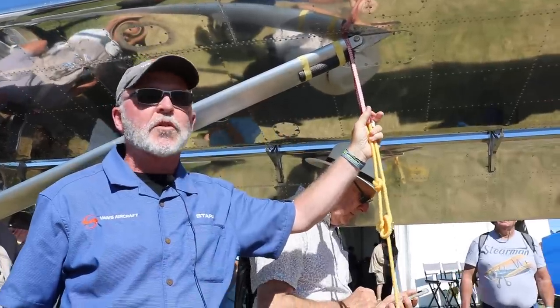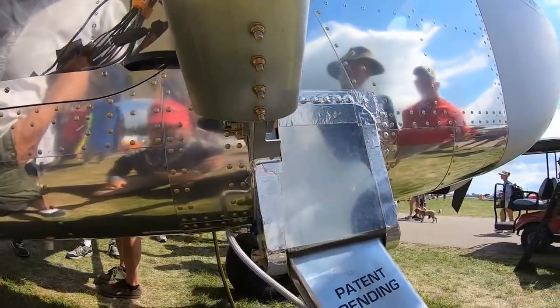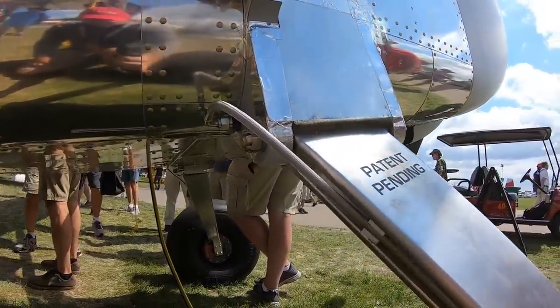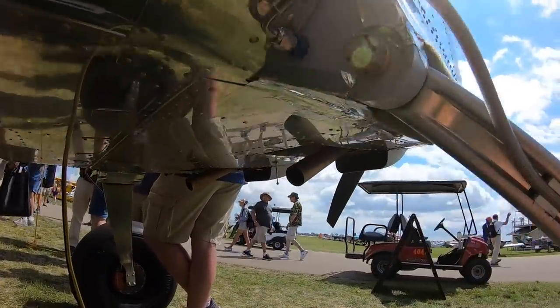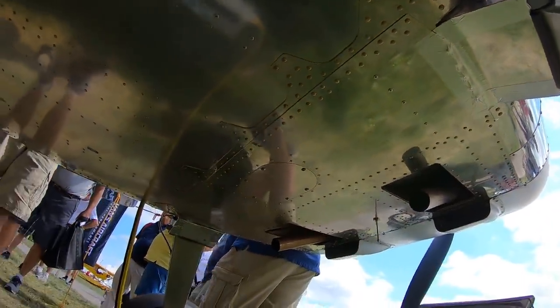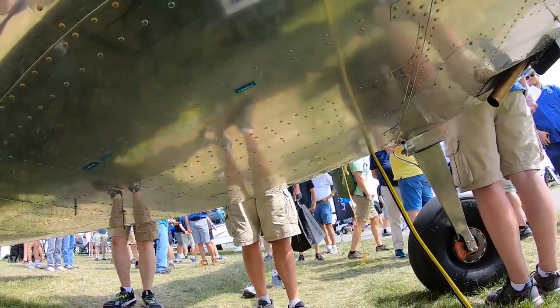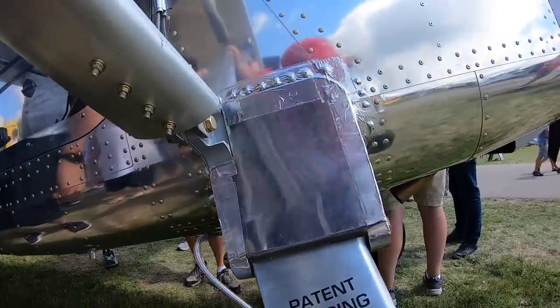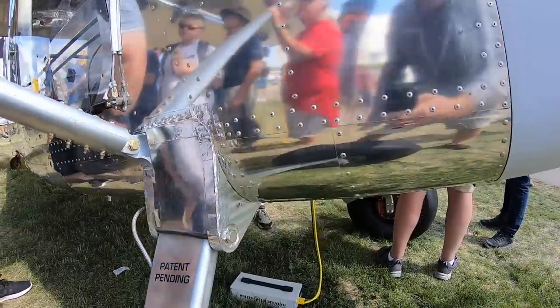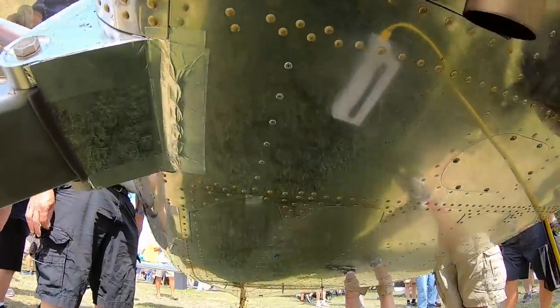So we're currently finishing up and doing the work. One of our engineers, who worked at Boeing for years and did material test analysis, has been doing hundreds and hundreds of tests on different types of sheet metal and different qualities of hole, deburred or not deburred, dimpled or not dimpled, solid flush rivets, pop flush rivets, or pulled rivets. These are the LP4-3s, the same rivet we use on the RV-12, this pulled rivet.